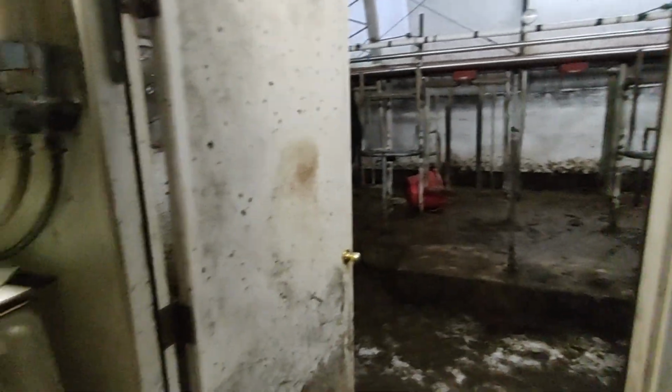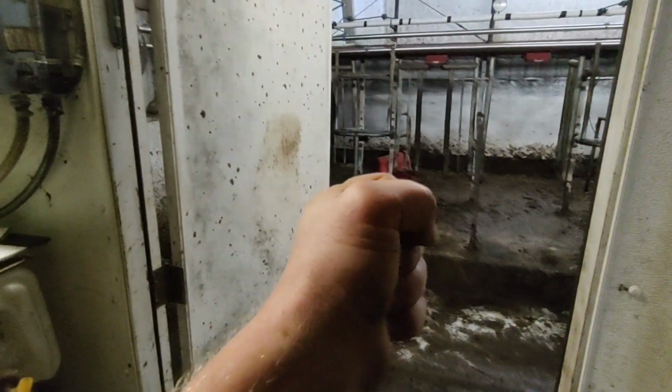And like I say, there's still an intermittent problem, but it really hadn't affected anything milking. You come in here and it's affecting the front quarters, which would be that orange light there. And every once in a while you just see a little bit of a flicker. Instead of a nice flash, you just see a little bit of a flicker. Now this morning they got bad. Some cows sometimes didn't seem to be milking. And I would stick my finger down the inflation, and there's times, 4 to 6 pulses, it was just gripped and wasn't letting go.